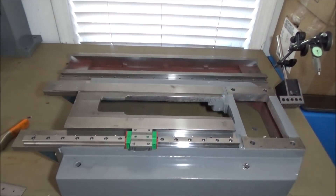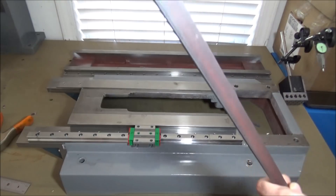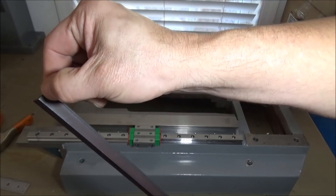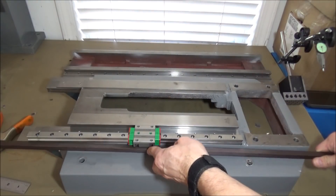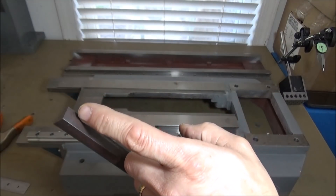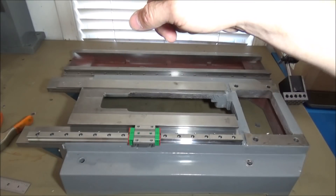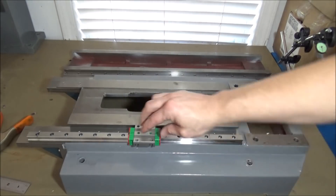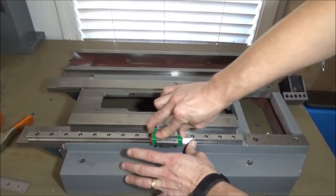This will add some rigidity to the overall system on the Y-axis. The rails are flush here, so I could use some straight bar stock. I picked up some half-inch by half-inch angle, and the plan was to machine this down so it just has a little bit protruding, then bore some holes and use that as a clamp — just go up against there and keep it pushed up against the datum. On the X-axis it does need to go over a little bit, and on the Z-axis they're about flush too. I'm going to work on these clamps next and then start installing the rails. Really happy so far — everything seems to be turning out really nice and it's going to be really smooth once installed.